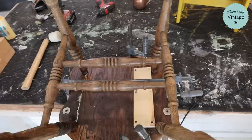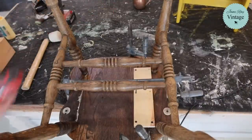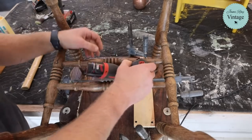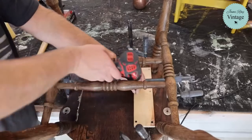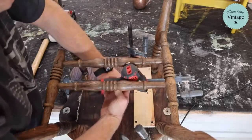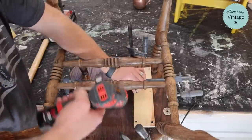Mama Neal says she has two chairs with cane bottoms — would she go back with that or something different? If the caning is broken, I would just replace it with a piece of plywood, upholster the seats, and then screw them in from the bottom, just because caning is notoriously hard to fix. Caning is coming back in popularity, so if you have patience you could re-cane it, but if you haven't done it before you might not get out the time you put into it. Stylistically, yes — caning is awesome.